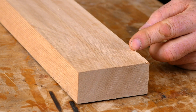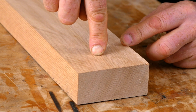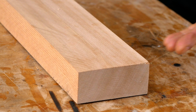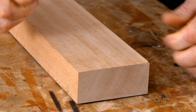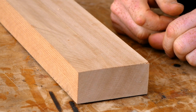If you see any visible cracks, come to the end of the visible crack, then go two inches further for red cedar or one inch for spruce and cut it off at that location. If that leaves your blank a little too short, you can pry the crack open, use a piece of paper to slide some glue in, clamp it shut overnight, and that solves the problem.